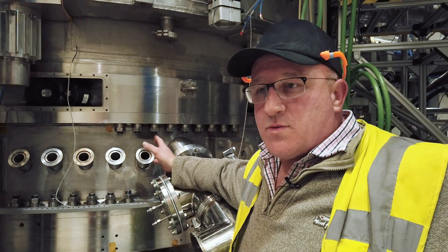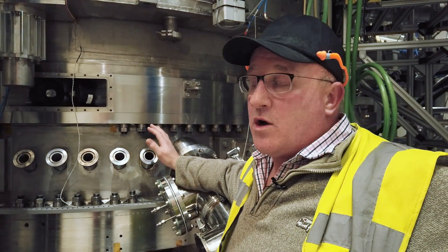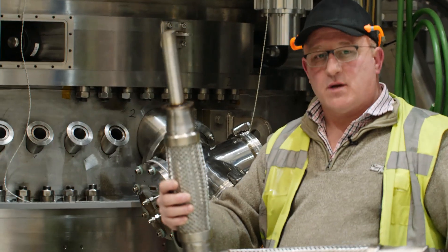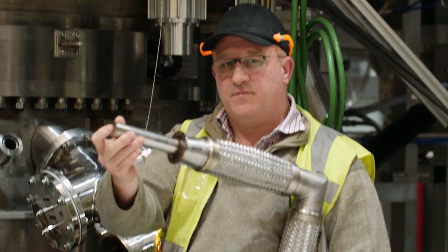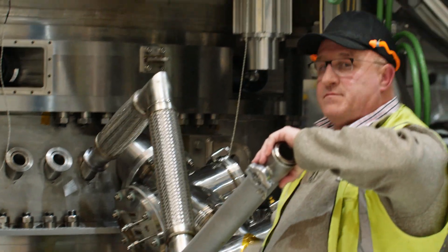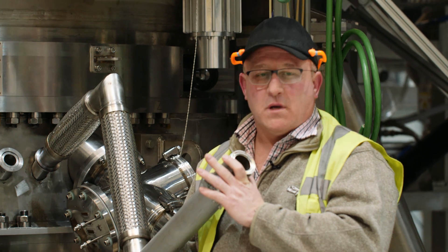They're very special connectors because we run the risk of building up a ball of ice. And ice, unfortunately, along with water is conductive. And we can't have any electrical conductivity between the liquid nitrogen system and ST40. So what we have is a liquid nitrogen line, a bayonet with an outer and an inner sleeve, and a vacuum. So there's actually a vacuum — this is a large thermos flask. And it fits in just like that, quick and easy.